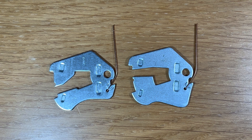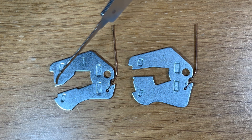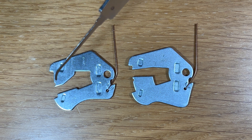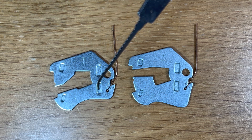I hope I'm not trying to teach you to suck eggs here, but it's important to understand these concepts. If you look at lever number 1, which is the highest lift lever, just before the bolt stump can have clear passage through, there's a little cut-out in the lever. That little cut-out is called an anti-pick notch. It's designed — if you're picking the lever and lifting it up — to get caught on the bolt stump and prevent the bolt stump from retracting through the levers.